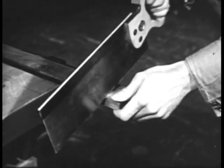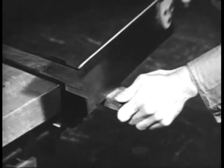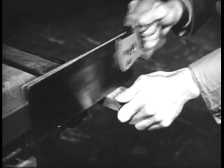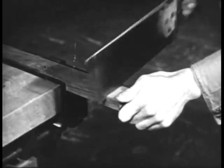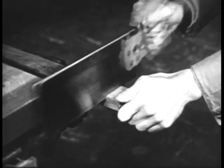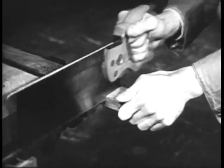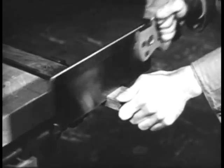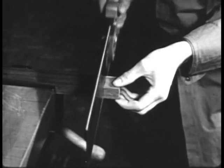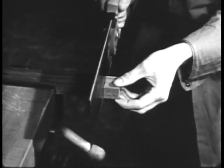Start with the middle of the saw blade. Using the thumb as a guide, carefully draw the saw towards you. The teeth should be beside the mark, so that the kerf will be in the waste piece. As you saw, lower the handle until the saw is parallel with the board, being careful to keep the saw perpendicular to the work. At the end of the cut, take shorter, lighter strokes. Be sure to hold the loose end on the last few strokes to keep the wood from splitting.